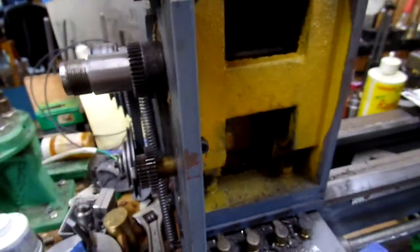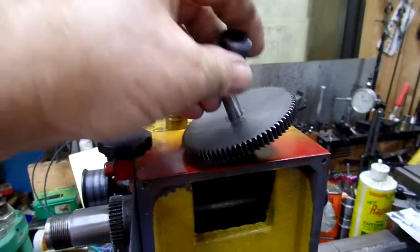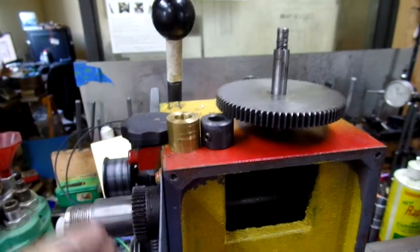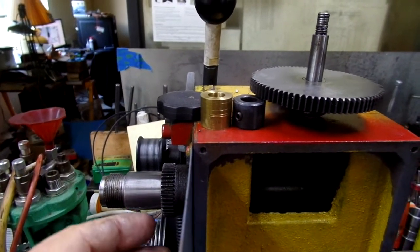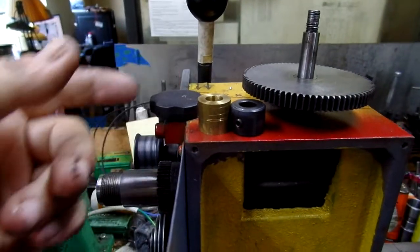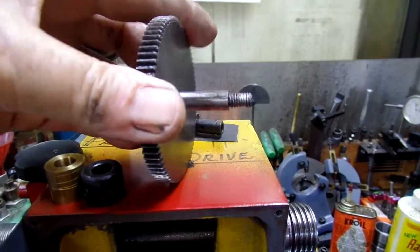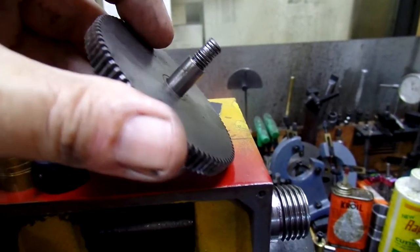This is the original spacer. And it's a bit confusing. It's got a set screw in it, which I found it doesn't need to be tight. The gears did not line up well on the spindle gear, and that's what I chose as a base. So I made a longer spacer, and I was going along with that. I mentioned the set screws that engage the threads and lock it up.